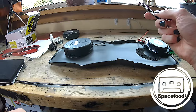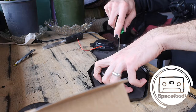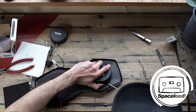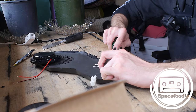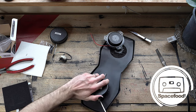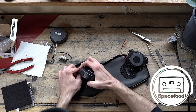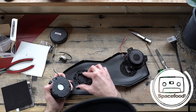So the reason why Subpac is so effective at transmitting the sub-frequencies to you accurately is that the vibrations are being transduced right into your body, and basically you're not relying on some subwoofer to pressurize the air inside of a room. Just like a slide whistle, where you make the chamber of air longer and it lowers the pitch, the same sort of thing happens inside of your room when you're pressurizing that air. Depending on the length and width and height and the combination of those dimensions, you'll actually get little peaks in bass frequencies and also nulls in bass frequencies. So areas of your room where it might sound loud and super bassy, and other areas where it doesn't feel bassy at all.